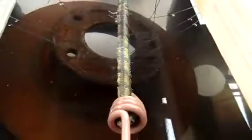If it'll fit. It doesn't have to be a perfect fit. It can just go in rough like I've done. But as long as there's area for the electrons to flow from that to the brake rotor, it should work alright. Well, it took a little bit of fiddling and playing around, but I did manage to get it in there. I had to move the anodes to the side of it, but that's alright. As you can see, it is angled slightly, so the base of it will get electrons hitting it.